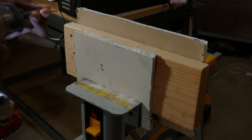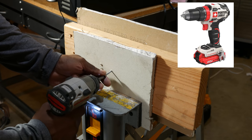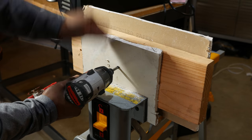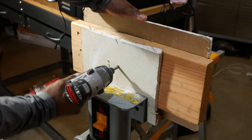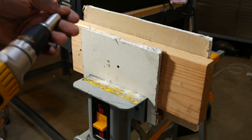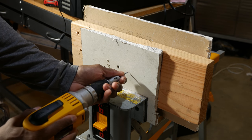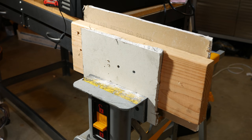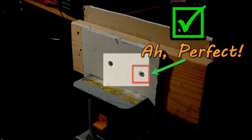The most popular methods for installing screws is to use drill drivers and impact drivers. The problem with those tools is that they don't drive the screws to a consistent depth. If a drywall screw is driven too deeply it can cause damage to the drywall or cause the drywall to separate from the framing over time. The set it and forget it consistency of a drywall screwdriver, also known as a drywall screw gun, makes it the most appropriate tool for drywall screw installation.